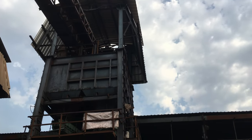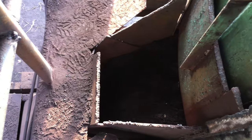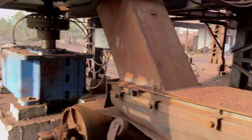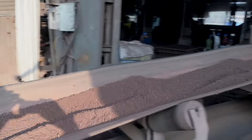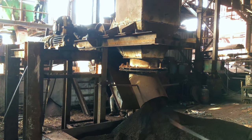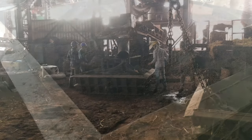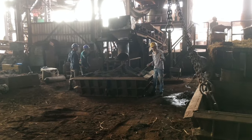Let's move on to the video. Before sintering, granulation process is done. Granulation is the homogenization of iron ore in a pan mixture machine with 6-8% of water in it, with the objective of obtaining a pre-agglomerated product. The agglomeration is in the form of micro-pellets. These micro-pellets are then conveyed to the sintering unit as you are watching.